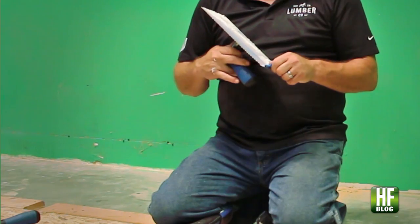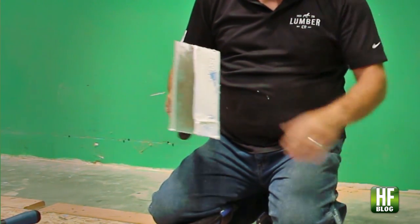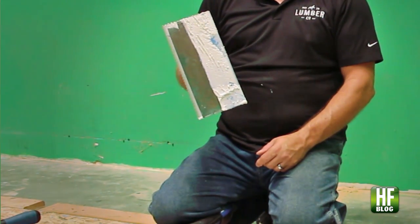So a little trick I like to do so I don't waste them: we're going to spread glue for a couple hours and go have some dinner — I'm going to put this blue tape on here. I'm going to cut it down so I can get to my metering portion. At the end of the day, I peel this tape off. It makes it a whole lot easier to clean up. All I've got to do is worry about cleaning up that one sharp edge right there. It makes it real easy, it makes it simple, and I don't waste money on trowels.